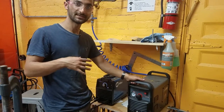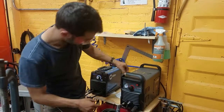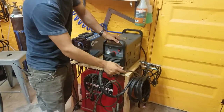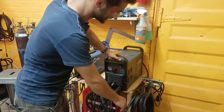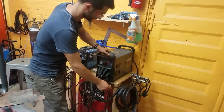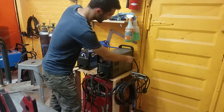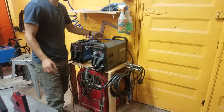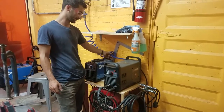More amperage and more air is for thicker things; less amperage and less air is for thinner things. In terms of the plugs going into it, this goes to a ground clamp or work clamp — same idea as with other kinds of arc welding. You need to form a circuit, so this connects to your material. There's a power cord that plugs into the wall, and then this is your torch. The only other thing is that compressed air comes in the back.